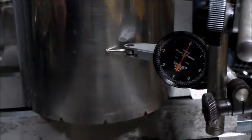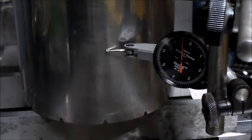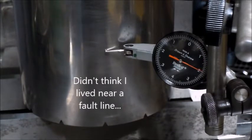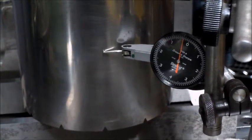I was surprised at the last results on the knee forward and backward. I knew it wasn't perfect but the last time I measured it, I didn't think it was that far out. So I was checking my setup and something was a little loose. This setup here is stronger than the last one, but - that doesn't sound good. Yeah, I've got the gib too tight now.